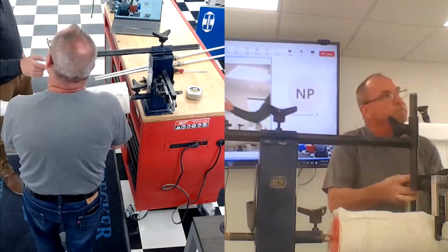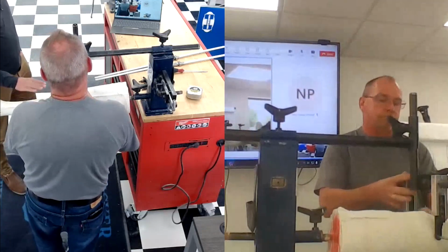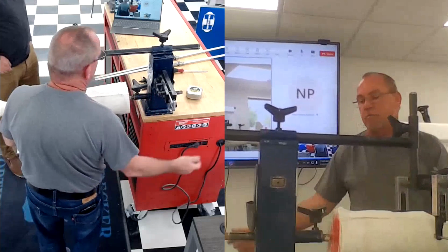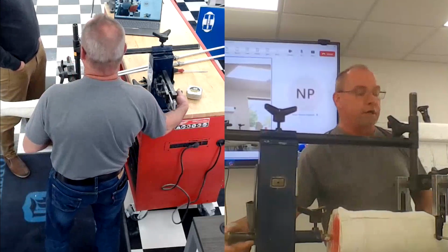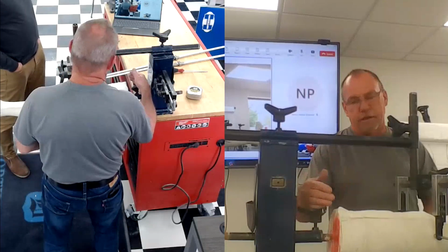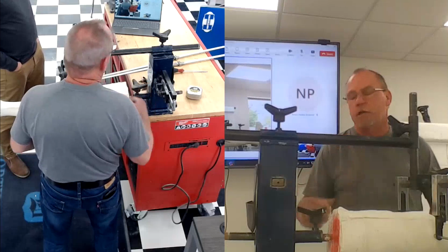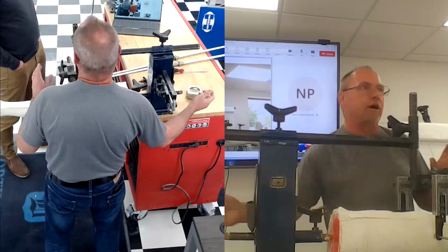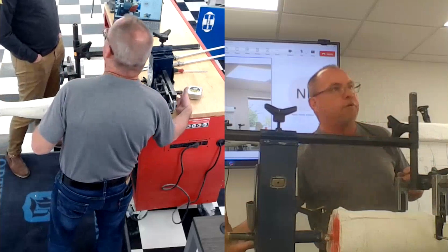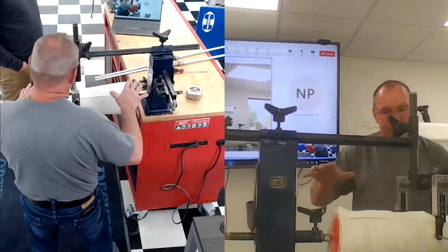You've locked in all of the different T handle spots. Now we also have to lock in our mandrel position first. Yes, we are locked in. Some people will put a wedge in the back. I don't find that necessary, but it depends on how strong your mandrel is. If your mandrel was really weak, we would take a metal wedge and drive it in between the mandrel and the fixture right here, just to make sure that it's nice and tight.